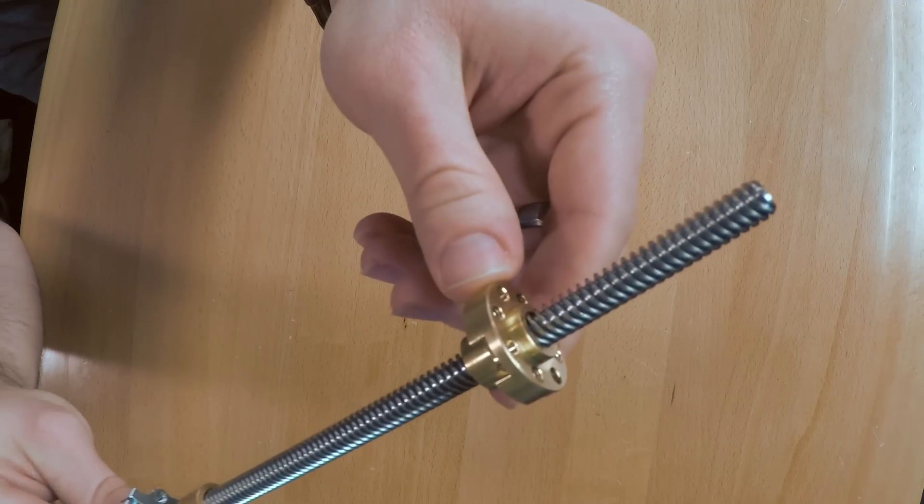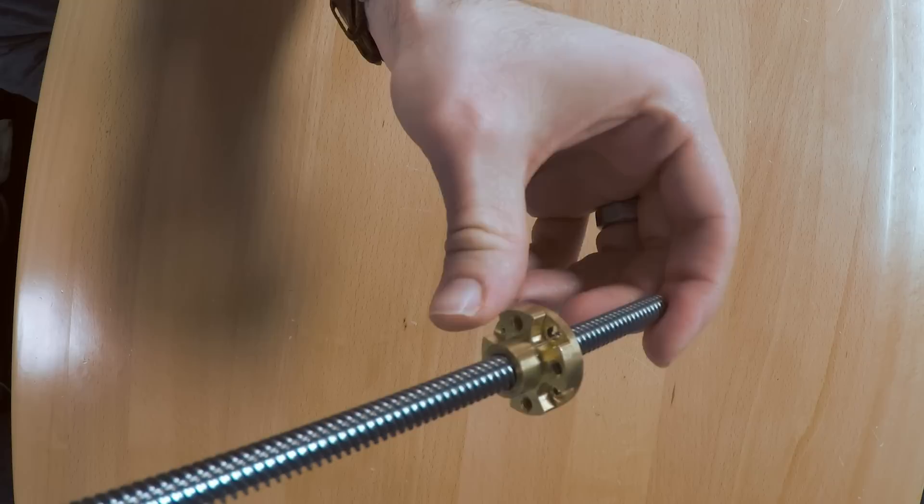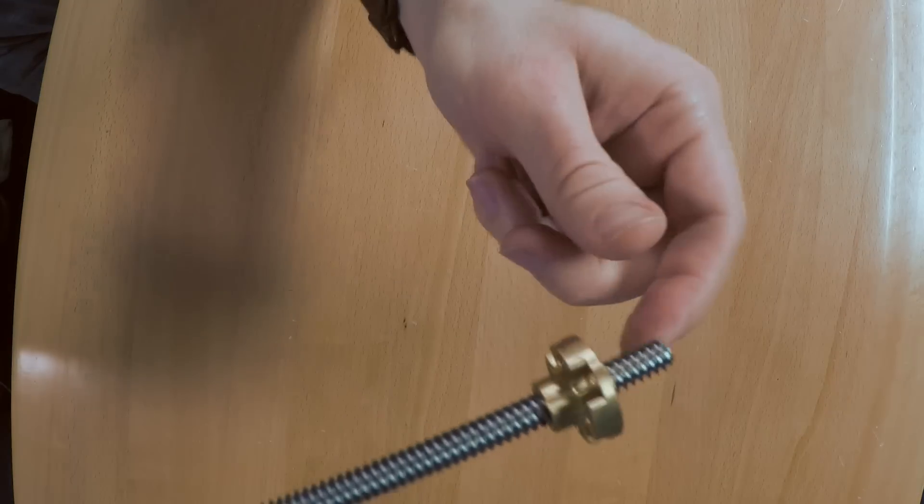The other version is more complex — it's a barrel nut with the Actobotics pattern already machined into it, so you can bolt a piece of channel or whatever Actobotics component you want directly to it. It also has a 1 inch diameter, so if you want to clamp around it and index it the same way, you can. Lead screws are really nice because it takes many more rotations to move a given distance compared to, say, a timing belt — however, you get a lot more linear thrust. It's a tradeoff between speed and linear thrust.